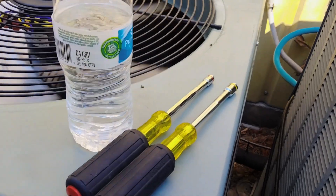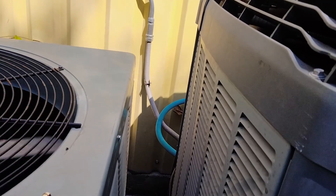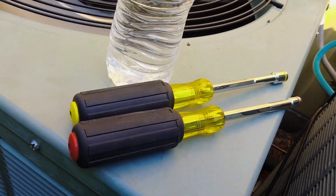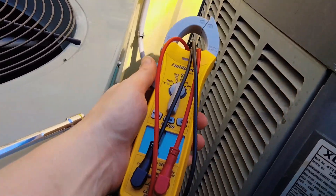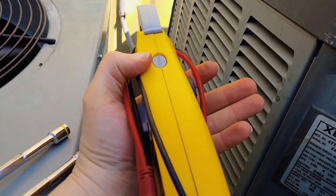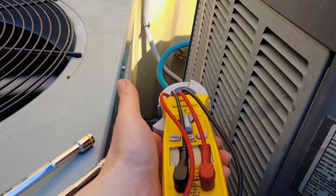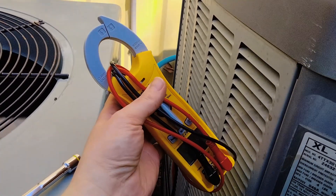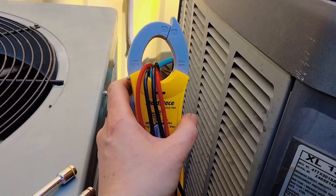Let's get over to the electrical panel. For the most part, many units you're going to need either a 5/16 nut driver or a quarter inch — I've noticed a lot of units are quarter inch but there can be 5/16 or quarter. You're going to need those, and then obviously you're going to need your capacitor you just bought. It's going to be wise to have a meter. These can usually be over a hundred dollars just because of all the things it can do while you're in the field — it's magnetic, it has a clamp, it has a non-contact voltage. You can find some of these at places like Harbor Freight for around 40 to 50 bucks. It's really good to have one just to make sure that you aren't going to get electrocuted, or if you need to make sure that you have 24 volts or 240 coming into your unit while you're in there replacing your capacitor.